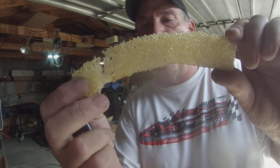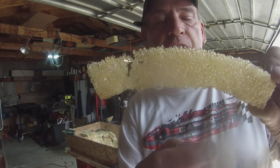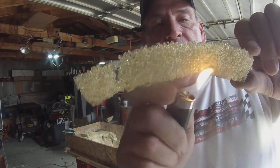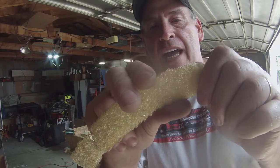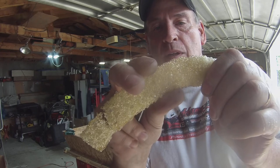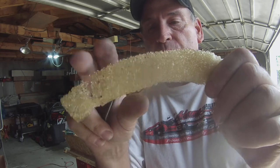See? Well, I think we gotta go a bit more. This piece here is still pretty stiff. I mean, we can leave it there because you're gonna body work this stuff. You're gonna sand on it and form it and round it up and what have you. Again, it's just to give you an edge to fill clay from, and of course you can sand it back, you can change it, you can alter it.